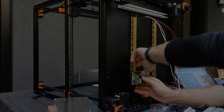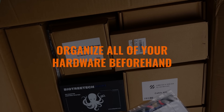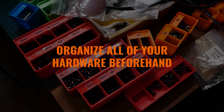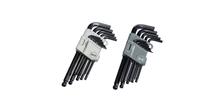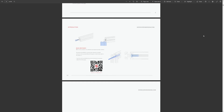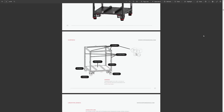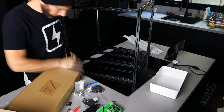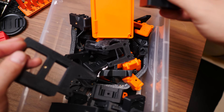The lesson is clear: if you're going to build a Voron, have a dedicated workspace that can withstand being covered in parts for a month or more. Organize all of your hardware beforehand — possibly in Gridfinity bins or at least a system of trays — and put your tools back every time you're done using them. I can't tell you how much time I wasted just looking for the right sized Allen key, because this build requires about six of them. Additionally, it really does make sense to create a build plan beforehand. While I skimmed through the main build manual as recommended, I failed to plan out which upgrades I would be doing and how that would alter the path I'd need to take, costing me time, patience, and a lot of filament as I printed and reprinted parts I never ended up using.